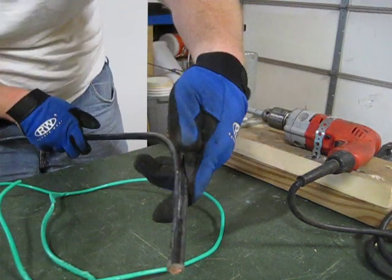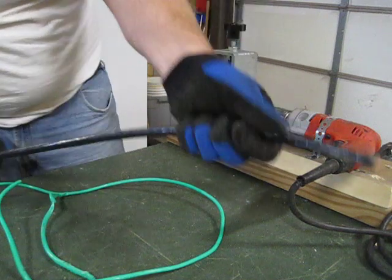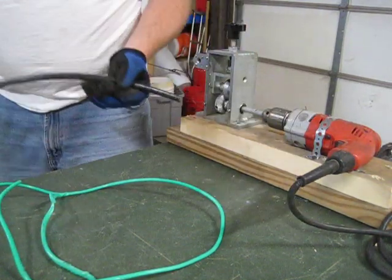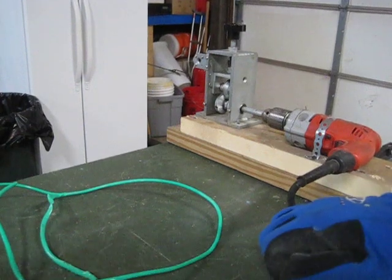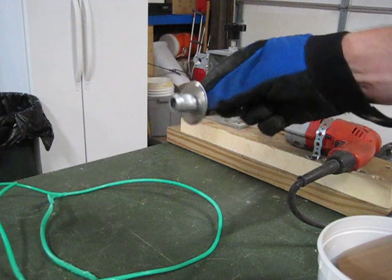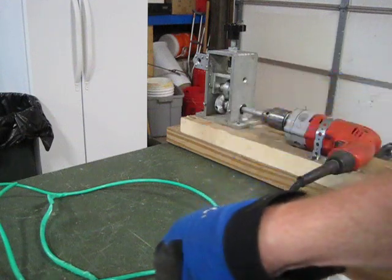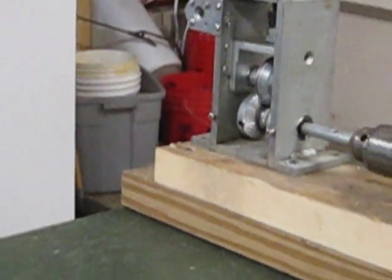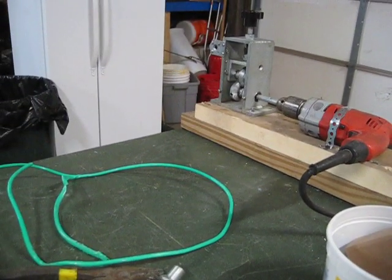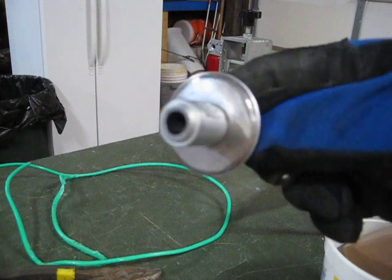This is 2-0 wire, so that's pretty thick. And this stripper — I need to put the other blade on it. It comes with two blades. This is the blade for the larger cables, because the smaller blade over there has a wire guide on it. You can see it's got the wire guide that holds that smaller cable in there — it works awesome. I don't know if any other cable stripper has that, but it works awesome. So I just throw this one on there and then do the larger cable — this buzzes right through it.